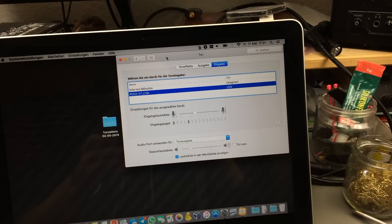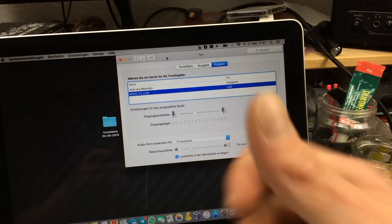I have this connected to my little MacBook and I'm getting closer to the mic — it totally works. It's a completely working mic. That wasn't a very hard repair if you know what you're doing. If you're looking for something like this on eBay, look for loose contacts — you know you can most likely fix those. If I hadn't been able to fix this, I probably would have sold it for the same amount as a broken unit and given somebody else the chance to try. But yeah, this is a working Rode USB microphone that I got for 50 euros and about 1 euro for the little USB jack.